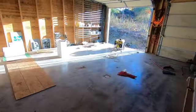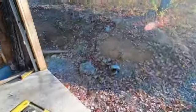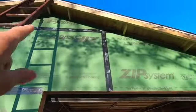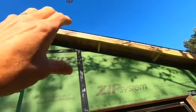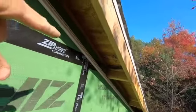So what I'm going to do today — I'll show you a little bit later — I'm going to run pieces of F-channel straight down here, put my soffit in, then put the fascia coming down the gable end, and we'll put these boxes up with aluminum. I've got my F-channel coming down the gable ends.